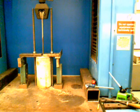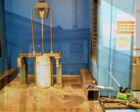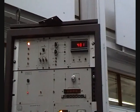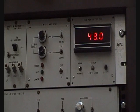As the machine began to pull the steel from the concrete there was not much displacement to be seen. The load increased gradually, reaching a maximum at about 48 kN. After this the load began to reduce and suddenly dropped from 44 kN to zero.